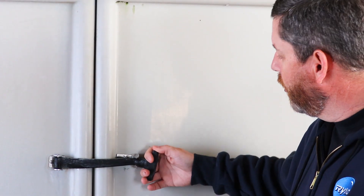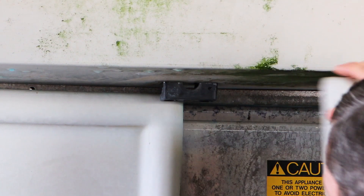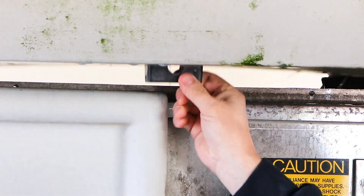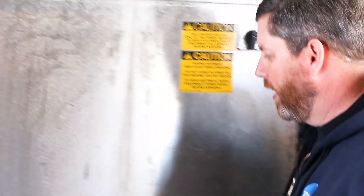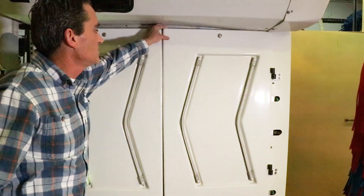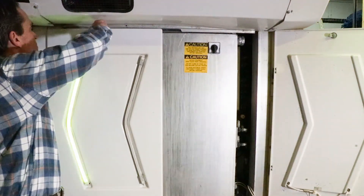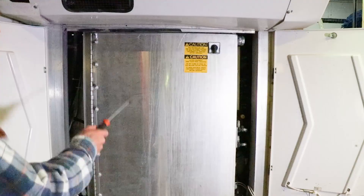While standing under the gantry, go to the right-hand covers and pull on the flexible latch to the right. For safety, the doors are held in place by a section on the cover above — just push up on this cover to release the doors. If the covers for your machine have LED lights on them, you can access the electrical panel by unscrewing the covers at the top to release the doors.